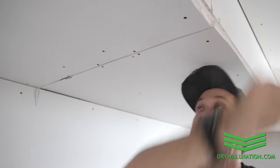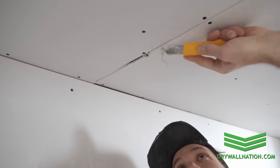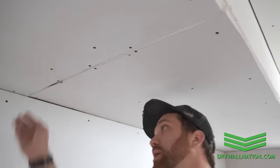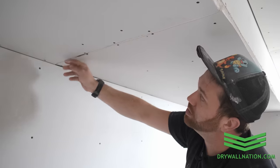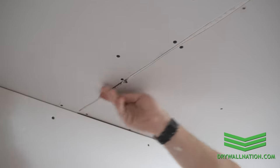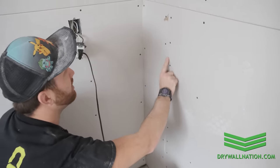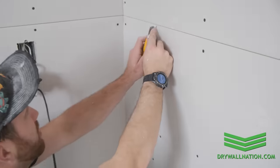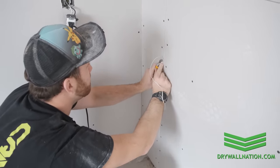After your tape is applied you don't want delamination from moisture along the edge of that sheet. We've v-grooved it, gotten rid of those extra little burrs along the paper, and now we're going to pre-fill that with some Durabond 90 to have a nice solid base coat to apply our tape on. This joint is pretty tight — not much of a gap — and it actually has a very nice factory edge, but all the same we're going to v-groove it just so we can get a nice solid base coat of Durabond in there.